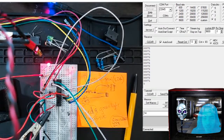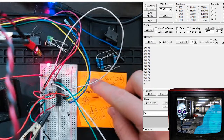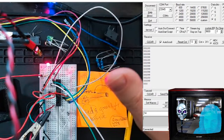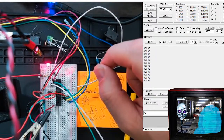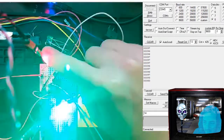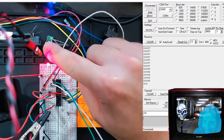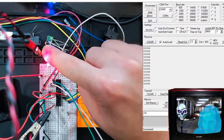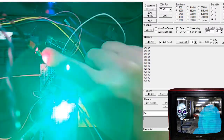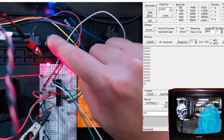Okay. So these are the actual values coming in from the chip. This was when I had the prescaler set. It doesn't matter as long as you set the code to have the correct threshold, when it's less than 50 or whatever. So you'll see it's getting 99 right now, okay? Now, if I put my finger in front, you'll see it goes to zero, right? Look at that. If I go a little bit over, 40, 50, okay? So I said when it triggers 50, to turn on the LED.